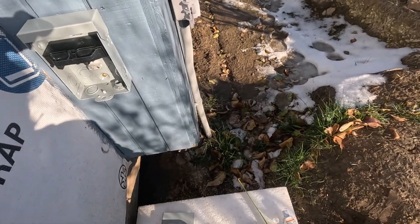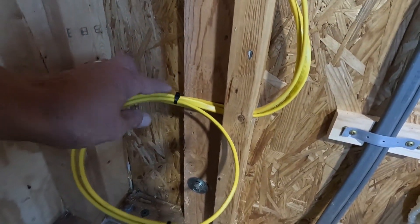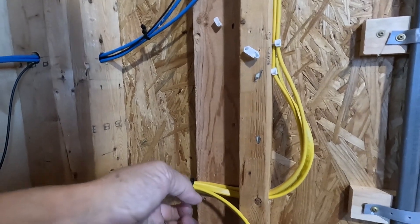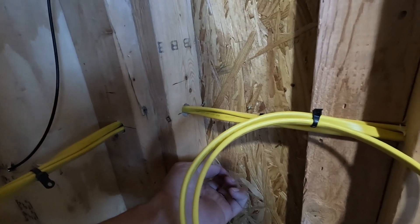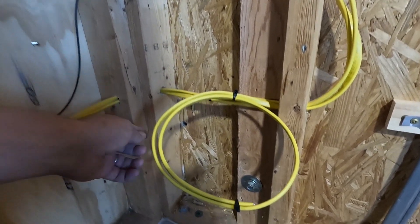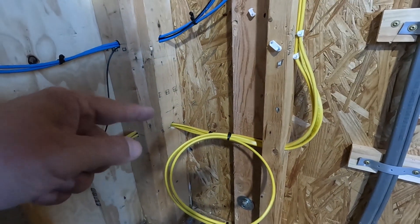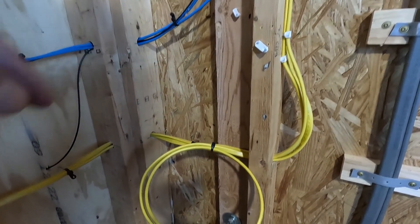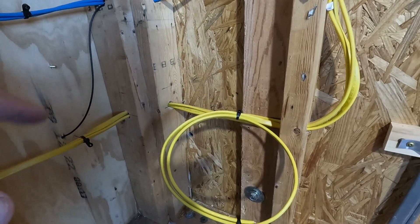Let's push our wire through and we'll get that wrapped up in here and then close this up and we are done with this. Here's the wire for this — we installed it yesterday and that goes to this bottom breaker. It's turned off right now. Just got to cut these zip ties, run it across to here, down, staple it there, and then run it into the box out there. I'm going to peel back the Romex to there and strip the wires down so we'll have bare wires out in the box.